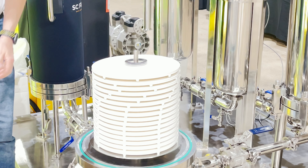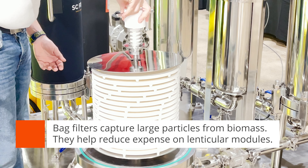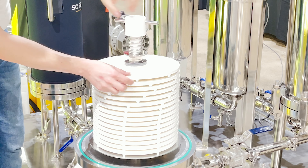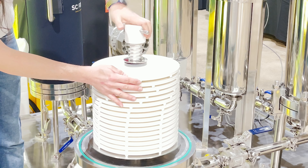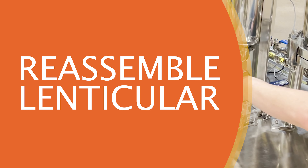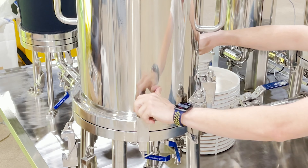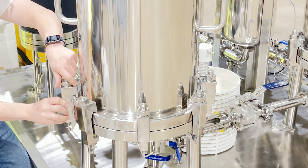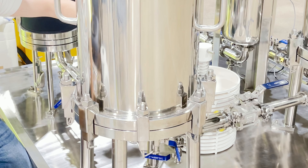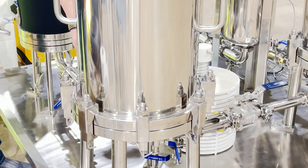Next, place the top plate on top — you can't mix them up because the hole diameter just wouldn't fit in the bottom. Screw the top adapter into the center post until it is nice and snug, because you want a compression fit on that plate. Once you've carefully placed the lid back over your lenticular modules, hand tighten the clamps, then use a wrench and tighten the nuts in a star pattern, crisscrossing from side to side, going two or three times to ensure a nice leak-proof fit.